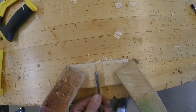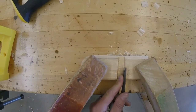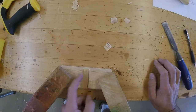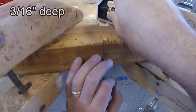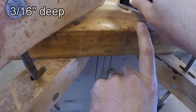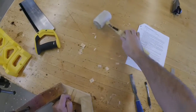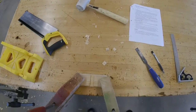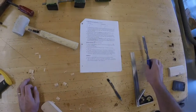I've got some edges right here I can clean up, very carefully holding this perpendicular. You can see my grain tear-out — I'm going to take that out so you can see what I did there. Alright, one last check for depth — and we are at three-sixteenths of an inch deep. My combination square sits flat on there with my gauge set at three-sixteenths.